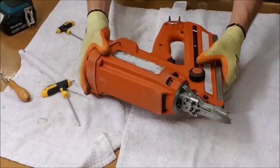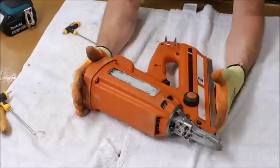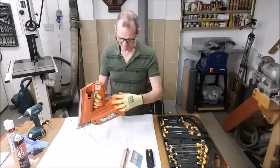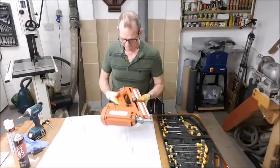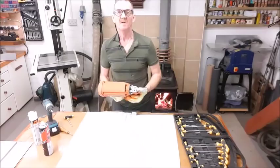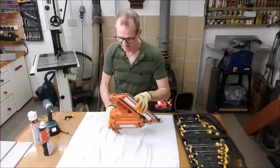And that is how to completely strip down the Paslode 350. Any parts you need you can easily find and replace having stripped it down to that degree. The last thing is to load it up and test it. Gas in first, then nails, then the battery — making sure you've got a good pulsation of green light. There's a block: press, squeeze — and that's working fine. I hope you've enjoyed that and found it of some use. If you've got any questions, put them in the comments and I'll get back to you as soon as I can. Thank you for watching, see you next time, bye for now.